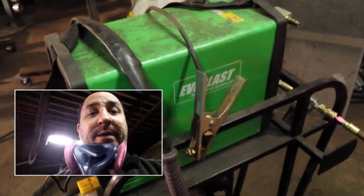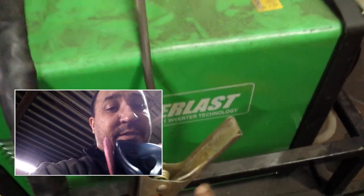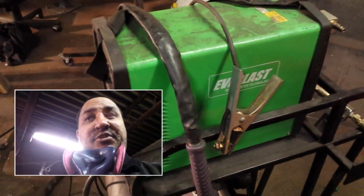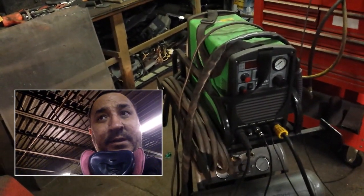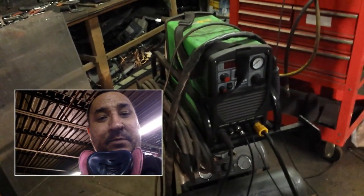There's a little air hose inside this machine, a little black air hose towards the bottom on this side of the case. It popped off of its fitting. It was just too much air pressure, popped off of the fitting, scared the hell out of me. But it was no big deal. I opened up the case, put the air line back on the fitting. It didn't break the hose, it just popped off. And I clamped down the clamp a little bit tighter, and never had a problem with it ever since.